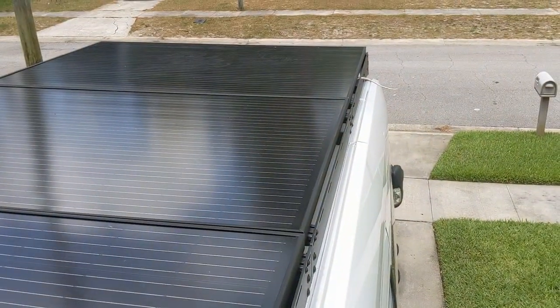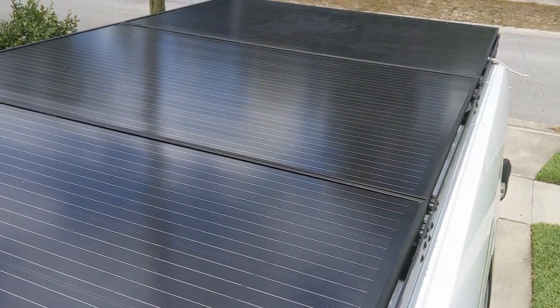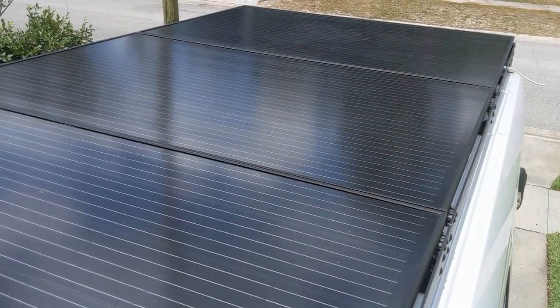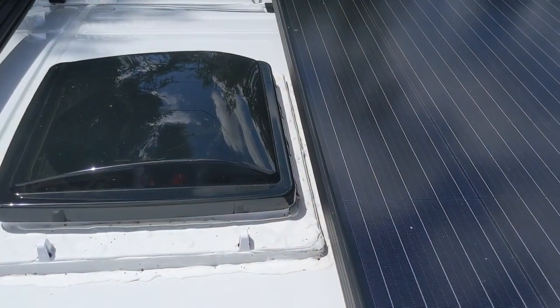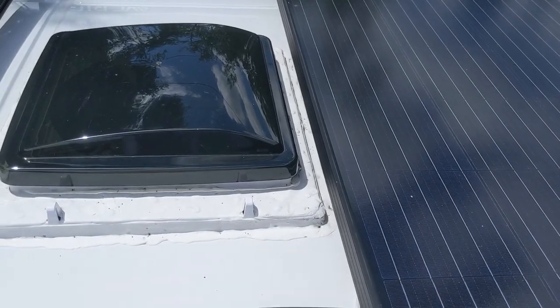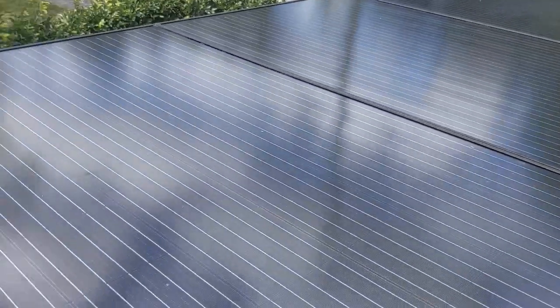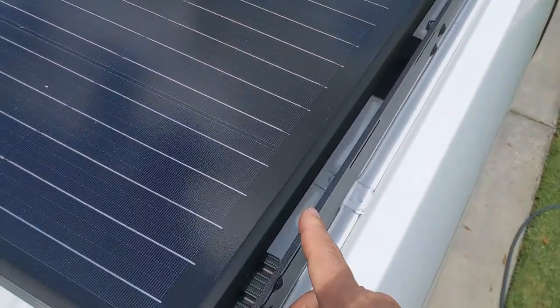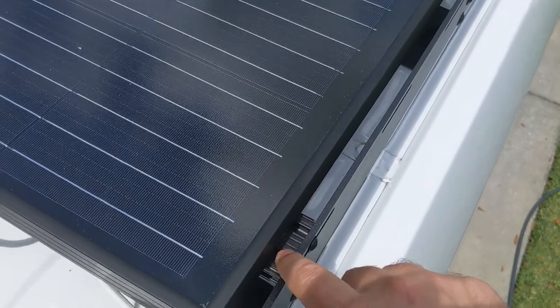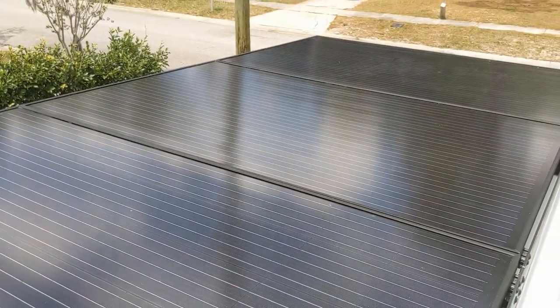I highly recommend it. And the panels that we got, which are 59 and some change by 39 and some change, you can see it's literally perfect. I mean, it comes within a half an inch once that's fully open. Couldn't have gone even an eighth of an inch bigger, honestly, or we would have had problems. So it couldn't have been any better. If it would have been any bigger lengthwise, I wouldn't have been able to get the UFO bolts in. So really, these are phenomenal solar panels that we got. Had to special order them.